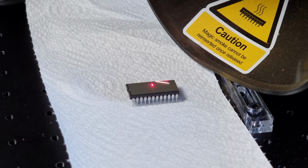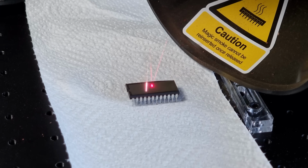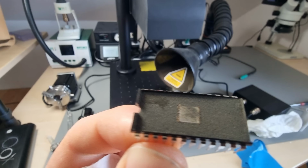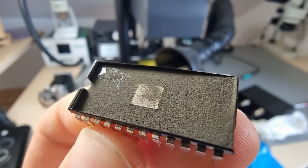plastic. If you're interested in taking a look at the silicon die, where there's usually a manufacturer logo and a part number, it's very important to stop lasing early, because the semiconductor features are at the very top surface of the die. A single round of 1064 nanometer bombardment will make it illegible. The last micron of plastic should be removed chemically, with warm nitric acid for example. In this case I didn't pay much attention and I went too far, unfortunately.